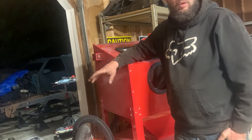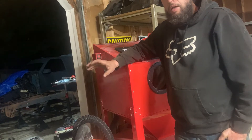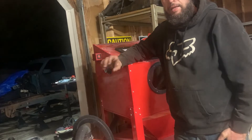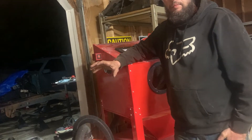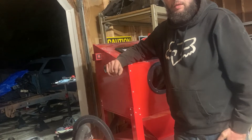I'm not too worried about the grit. It gives a nice finish on everything I've done — I've done aluminum, I've done steel — and both ended up with a really nice, smooth but not too smooth finish. You kind of want a light etch to it so the powder will stick, but you want it to be pretty smooth too. You don't want it to be like you sanded it with 80-grit or 60-grit sandpaper.